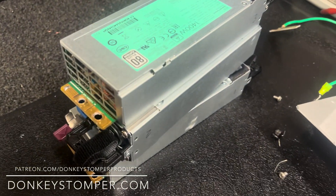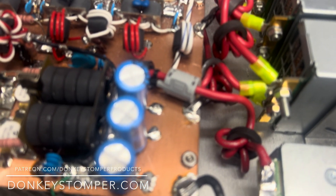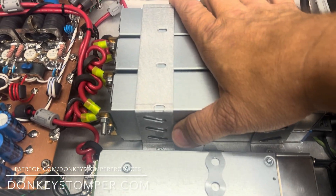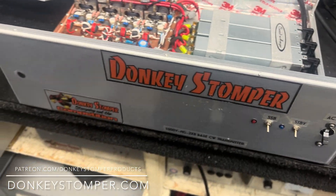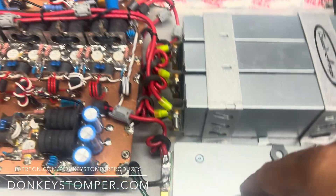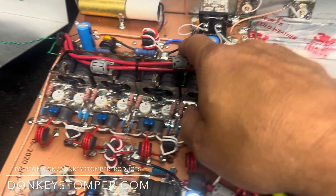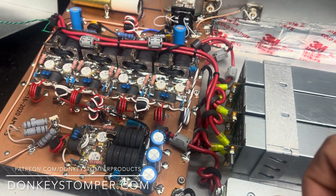Turned out we had some bad power supplies. I put three new ones in, got it running, got to working on it, and then it kicked off again. It was making big watts, so I went ahead and added one more power supply. Then I found that one of the original supplies was completely blown up, and two others weren't putting out. I also added another power supply to the driver. Then I got to keying and unkeying and it kept getting hot, burning this resistor — it was oscillating, but just this four-pill section, nothing else.